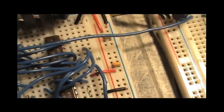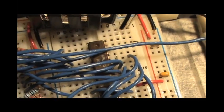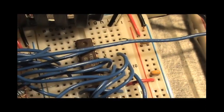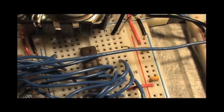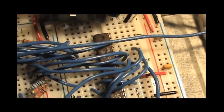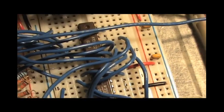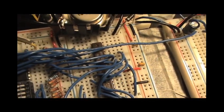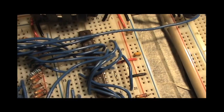This is the ROM. And in this case, this is a clone of a 7400 series PROM chip that has actually been programmed already. And it's programmed with some kind of characters. Like it's a character set. Of course, I've only been able to find web pages in Russian describing what is exactly going on. But in any case, it takes an 8-bit address as an input and gives 4-bit numbers as its output. So it's good enough as a ROM for now.